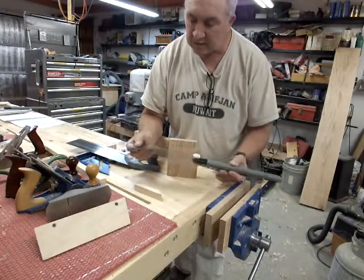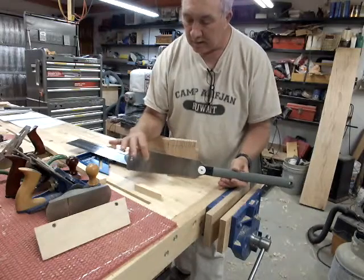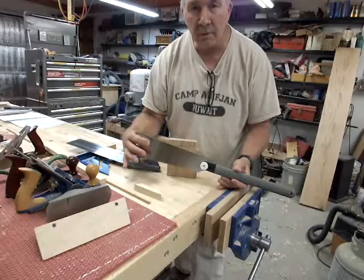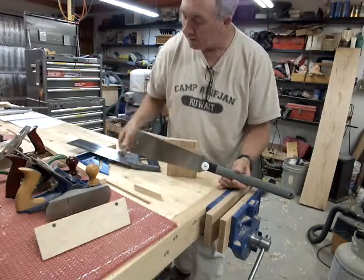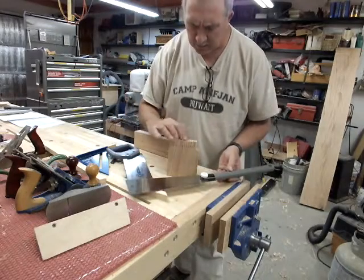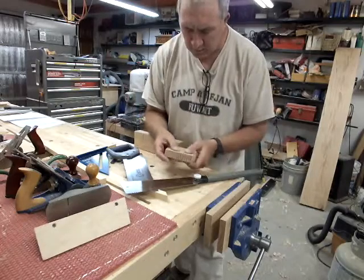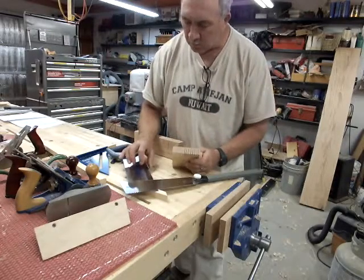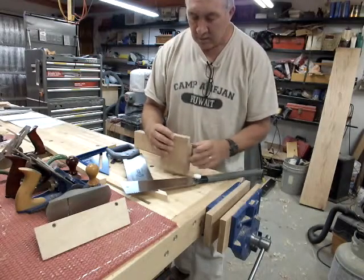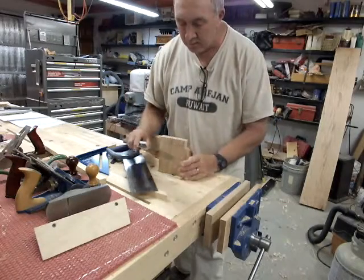And this is a fantastic saw with a very thin plate, cuts on the pull stroke. I should measure it for you. I think it's 25 thousandths or 27 thousandths of an inch. This will leave a kerf of about 30 thousandths of an inch. They're almost indiscernibly different. There's almost no difference. This cut will leave a slight little bit of exit tear out, but so will this one. It's just on the opposite side, so you have to think about what you're doing in dovetailing and so forth.